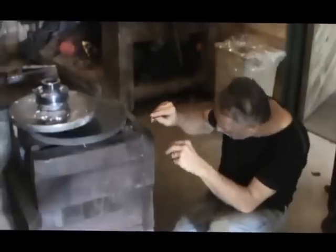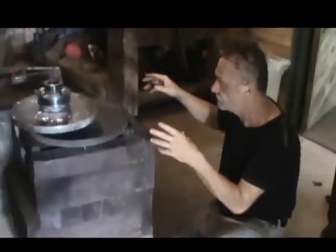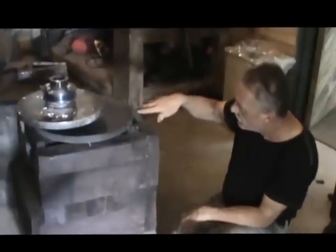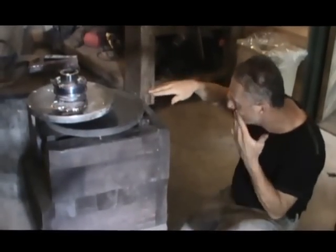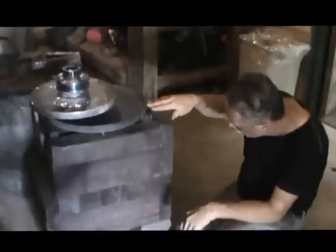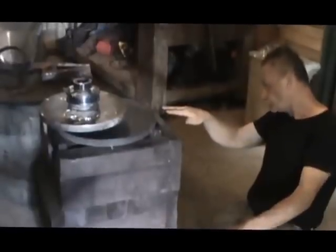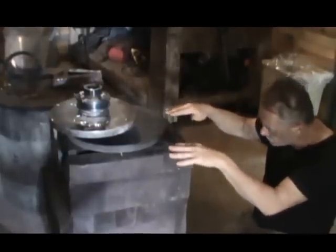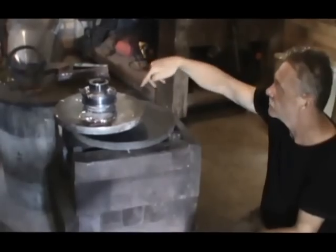So what we've done this time around is, while this thing was still warm, of course we were anxious, we wanted it to work, so we rushed and got this cast iron plate here. We cleaned it up, set our assembly back on here, and put the babbitt back in while it was still warm. Probably not the best thing to do because you can get burnt, but we did it anyways. So basically, with this cast iron plate, we're not getting any warpage. We cleaned it real good, so we had really good adhesion to the cast iron plate and to the main shaft that you see.